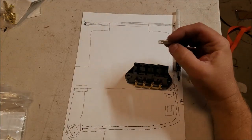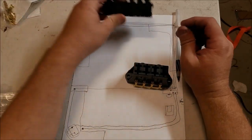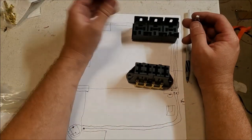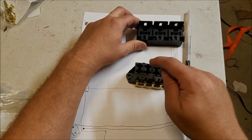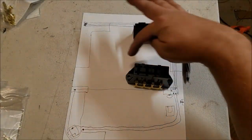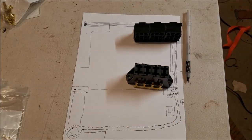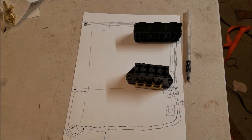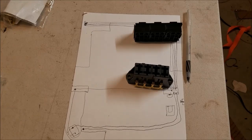After that, I'm going to have these terminals, which are obviously not a little bus bar, they're independent. So right above the fuse block, I will have the 3 relays from the fuse straight to the power port of the relay. This wire will bypass this, go to the switches. Switches will come back down and hit up in each one of these relays turned on. I hope that kind of makes sense. It's going to be pretty difficult to wire, and a lot to show you.